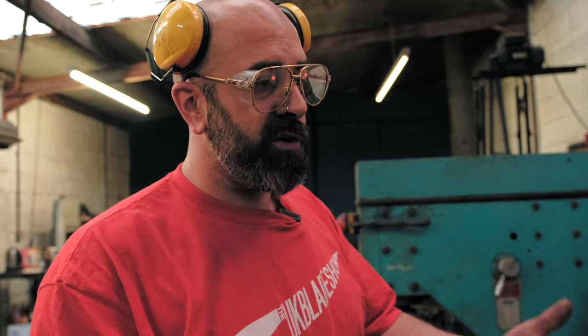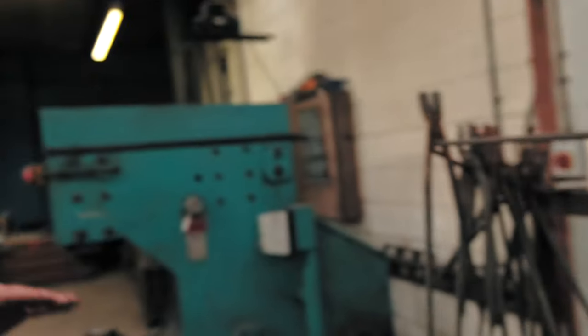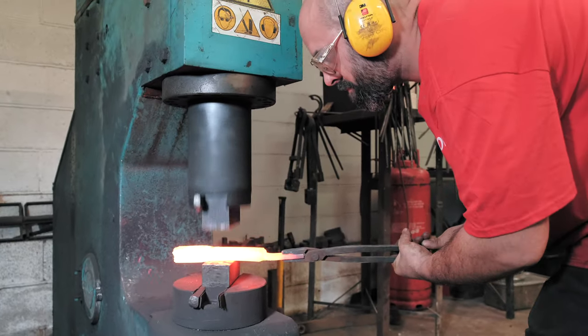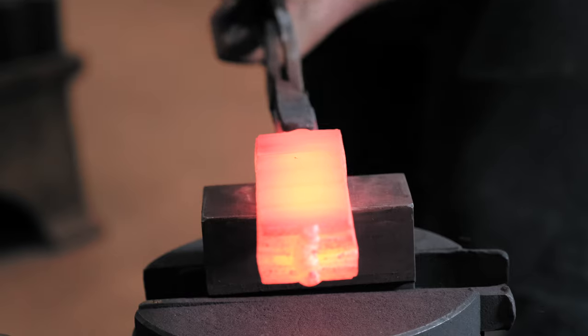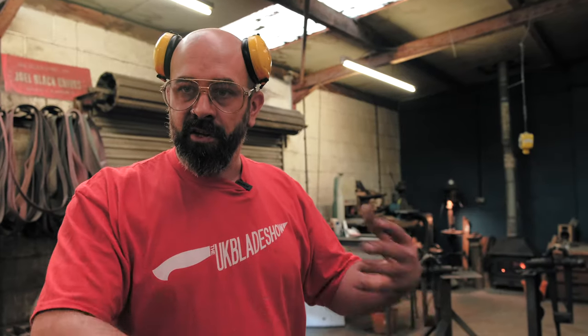Just want to get stuff hot slowly. When it comes up to temperature I'll weld it and then forge it quite quickly, so there's less oxidization. It does its thing better that way. It's going to come up to basically about 900, almost 1000 degrees, and then it's going to start sticking. Once it starts sticking we're good to go, and I can start forging in earnest — really using Bertha to her best, getting the material moving. The harder you hit stuff, the hotter it stays; you're pushing energy back into the material as you work it in different planes to keep the heat in there.